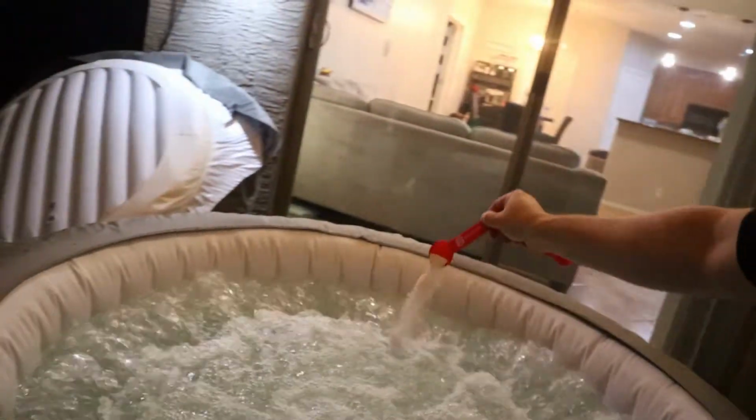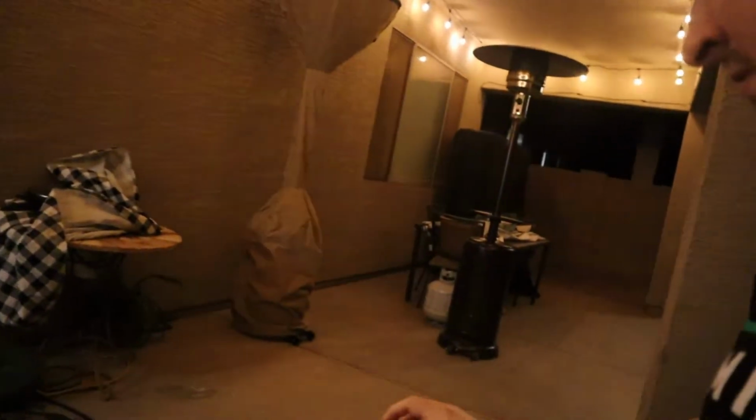About right. We'll mix that right in. Sorry, it's windy, it's blowing my hair all over the place. Mix that right in. Let the jets run for, I don't know, probably about 3 minutes or so, and that'll mix everything, mix the chlorine in.